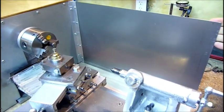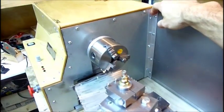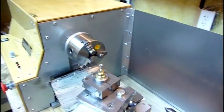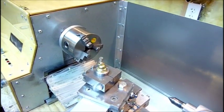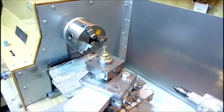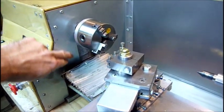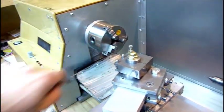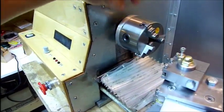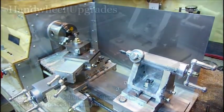The chip guard is composed of a fairly thick piece of steel in the back connected to the box, and also a front piece with a piece of angle aluminum. It keeps things fairly clean. Unlike the prior design, there's not a lot of places for the chips to go — before, they were getting into the motor and causing some potential issues. This keeps the case very clean, and I also tightened it up around the spindle so it looks a lot nicer.